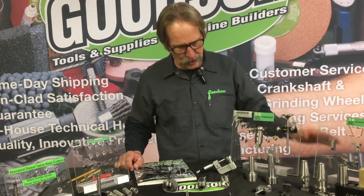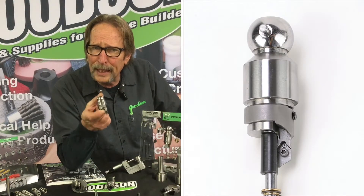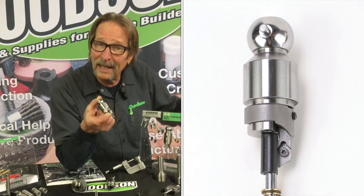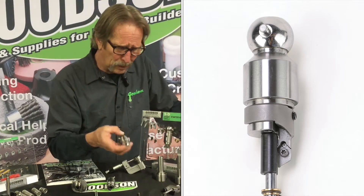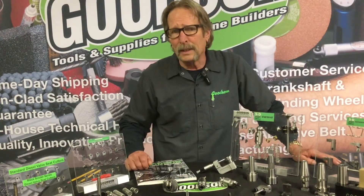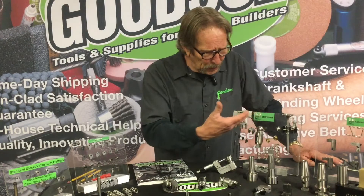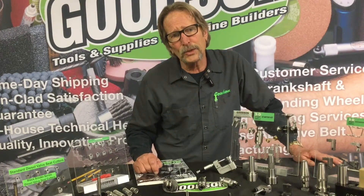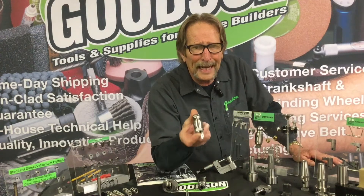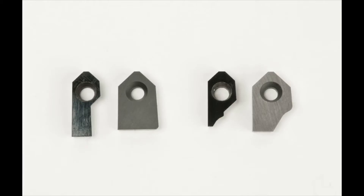Within the standard kit you have a range of a little over an inch to just over two inches. We also make a micro ball head — this one right here — for small diameter seats. Some of these multi-valve overhead cam cylinder heads have three, four, or even five valves. They have little bitty stems and little bitty seats. With the 3D Fast Cut system we want to use it as best we can, so the drive head is the same but we allow you to get down close to that half-inch seat. The tooltip holders and cutters are quite small as well.